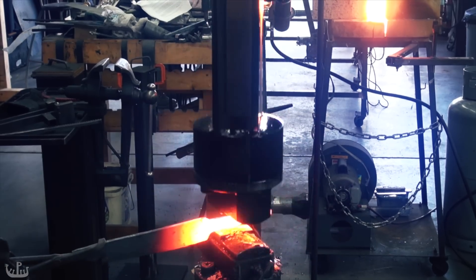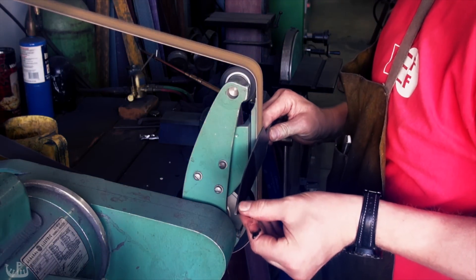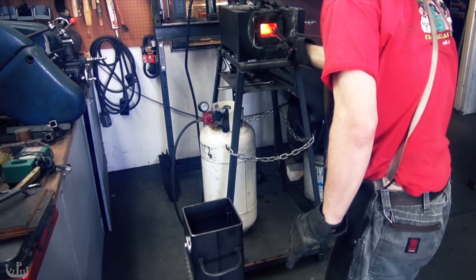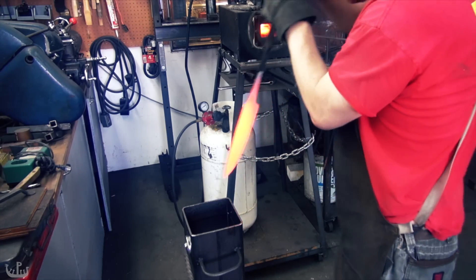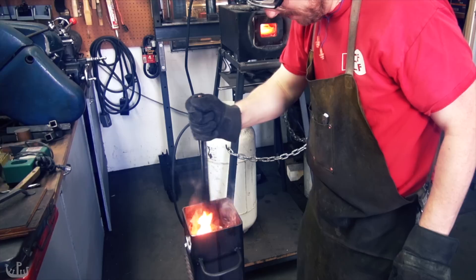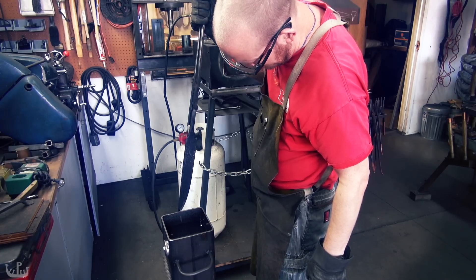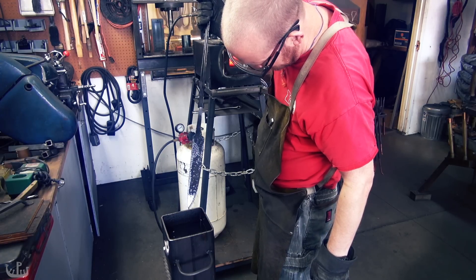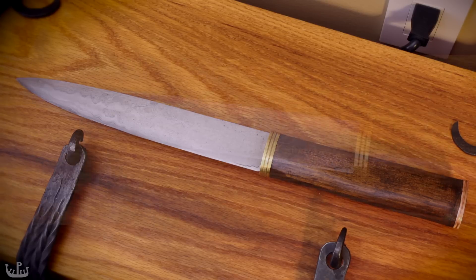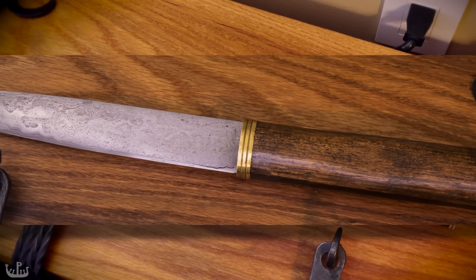After a while the basic shape of the knife has been forged. The blade then needs to be normalized to relieve stresses that build up during the forging process. Afterward it is ground thinner so that it can be heat treated. I heat treat in Parks 50, which is a very fast quenching oil and is almost as fast as water. Here is the finished knife. When you study the photo you can see the steel at the cutting edge and the refined iron closer to the back of the knife.